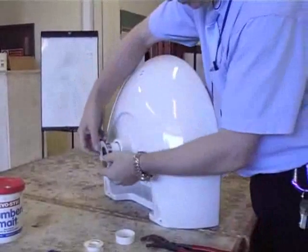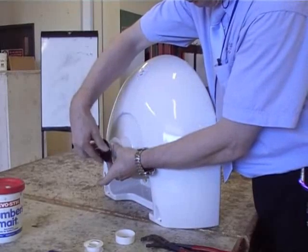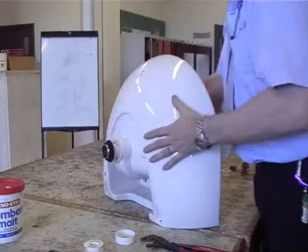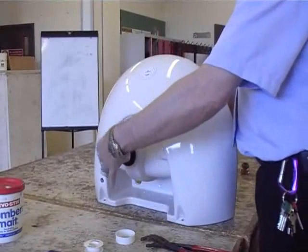There you see the PTFE tape — it's right where the nut's got to be. Poly washer on. You'll notice that even though I just pushed the slotted waste fitting in, it's not falling out, and you should be able to screw the nut without it moving. If it does turn the waste fitting, it means you've put too much PTFE tape on. So screw the nut up by hand as far as it can go.